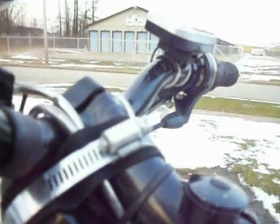I'll go ahead and put that in. But I ran the positive up to this button, ran it back down to the horn. I used some nylon to insulate the horn because this nut right here is actually the positive contact for the horn itself. The negative contact is one of those tab deals right there. So I used some nylon strap and some electrical tape on the hose clamp to try to isolate that so it wasn't shorting itself out or grounding itself out.